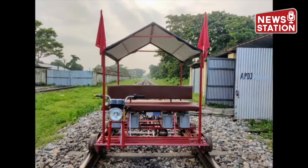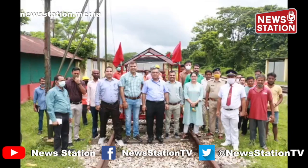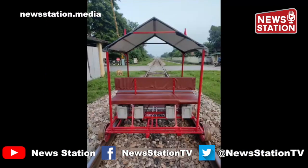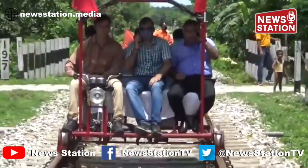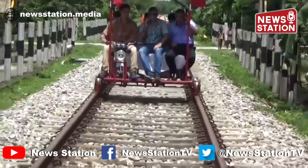Alipurdua division has successfully designed a lightweight electric trolley with the working principle being similar to that of an e-ricksha. This trolley uses lead acid batteries to operate a brushless DC motor, which then drives the rear axle of the trolley using a chain drive mechanism. The result is a trolley which produces less noise, is environment friendly, and has low maintenance costs as compared to conventional motor and moped trolleys.